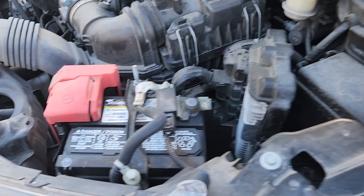There are videos out there of people using car batteries — that is absolutely the wrong solution for an emergency system unless it's a dire emergency. Car batteries are designed to supply a whole bunch of current for a short period of time. They're not designed to run low current over long periods of time. A typical car battery only has between about 50 to 80 amp hours of capacity unless you drive a big truck. So you're not getting any benefit by using a car battery. Go lithium. Just do it. Spend a couple extra dollars — the pros far outweigh the cost.